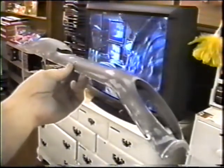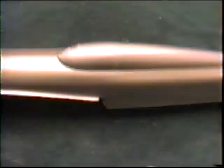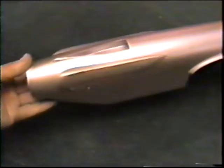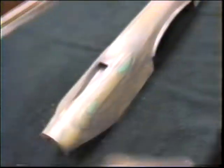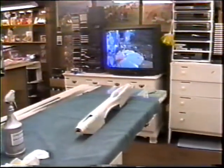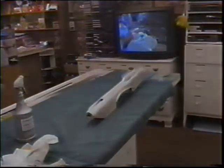I'm leaving on just a little more silver than normal on this because I'm hoping I'm not going to have those pinholes come back through to finish. We'll find out when we go to spray it tomorrow. These little areas — we'll put a final coat of silver on the whole part. As soon as I get these little spots sanded out, we're going to get outside. Hopefully today we can get a little paint done, though it looks pretty cold and gloomy out there.